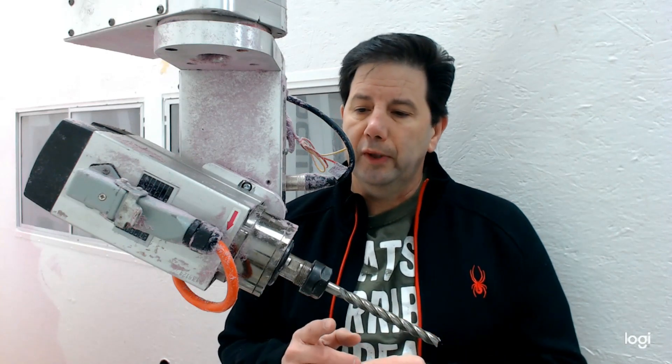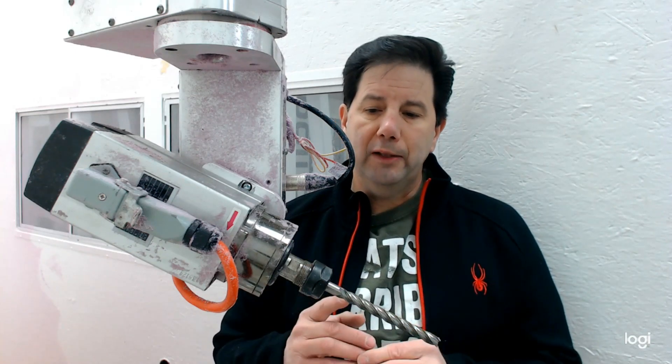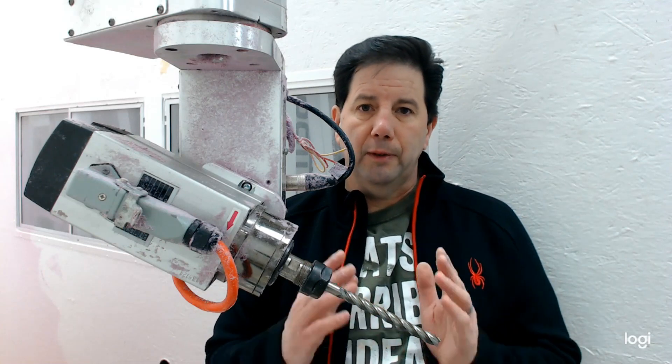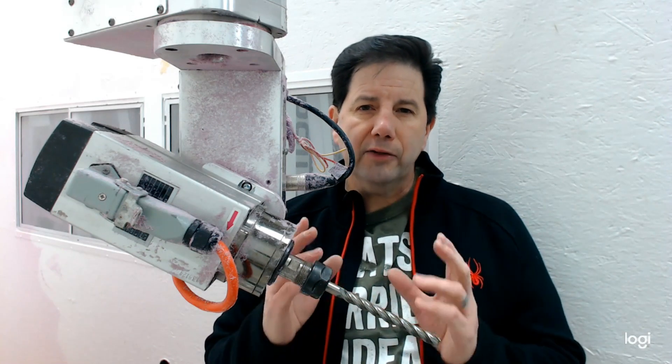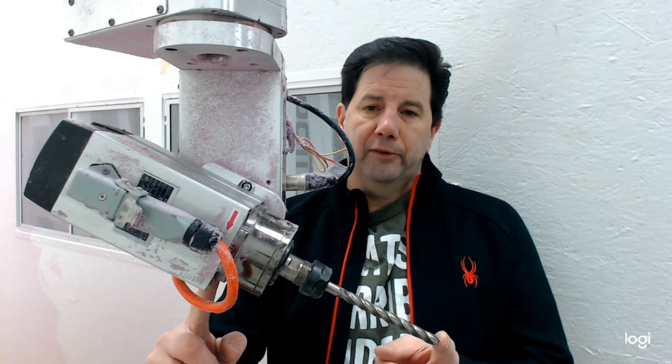The challenge we have, especially in these hobbyist machines, is you can't recalculate the kinematics on the fly. So once you set the tool length within the program, you're not able to change it again. Is kinematics important to you? Well, it really depends. If you only plan on using one tool and cutting your whole part without making tool changes, then it's not so critical — you can use a number of controllers like Mach 3, Mach 4, or the Masso unit without any problem. The challenge becomes if you need to make a tool change, because in the post-processor — in my case Mastercam and Fusion 360 — you have to tell it the tool length. And the tool length is really the articulation point, because that's what it uses in the math to determine where the spatial representation should be.